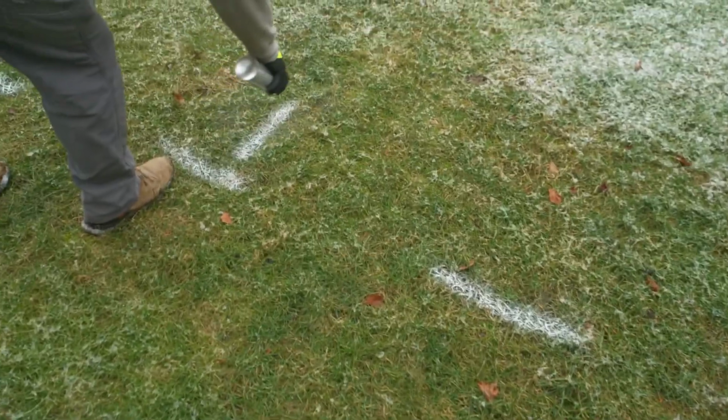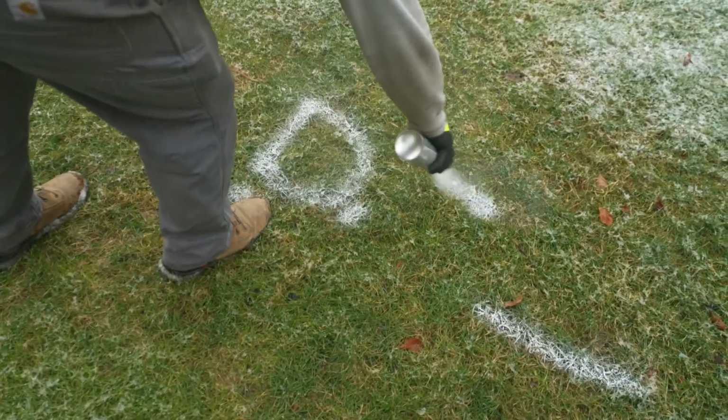Whenever you dig, it's important to avoid damaging any buried utility lines, so before any project, call 811. Your local utility companies will mark the location of any water, gas, and power lines in your yard. To be safe, you should hand dig any holes that are within 24 inches of a marked utility.